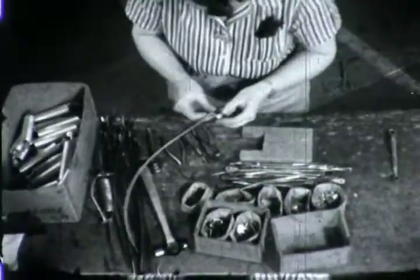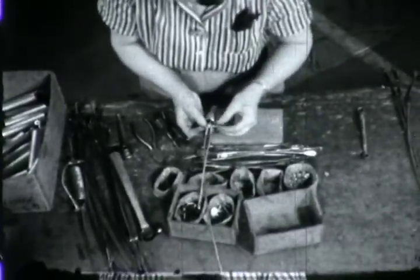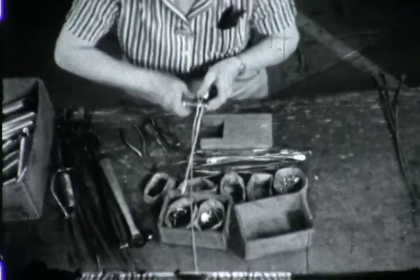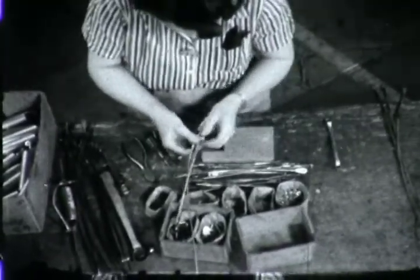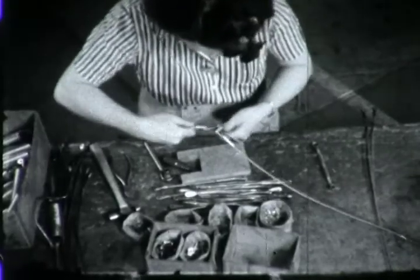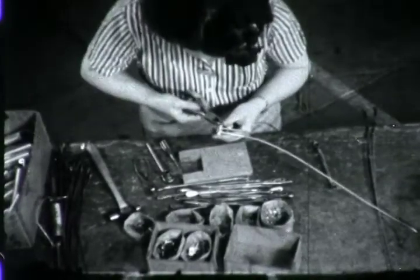Here's the first one-arm bandit working on the tail wheel control assembly for the monocoque of the Consolidated Vultee Basic Trainer. Cables are attached by bolt and nut to each end of the spring. A safety cable is connected between, and the assembly is made secure with a cotter pin. Actually, she is working with only one hand. The left hand is being used merely to hold the spring, while her right hand is doing all the work. She is breaking a simple rule of motion economy: don't use the hand as a holding device.